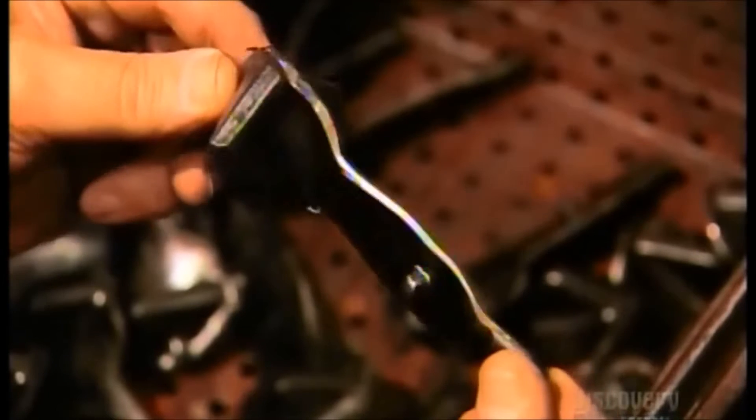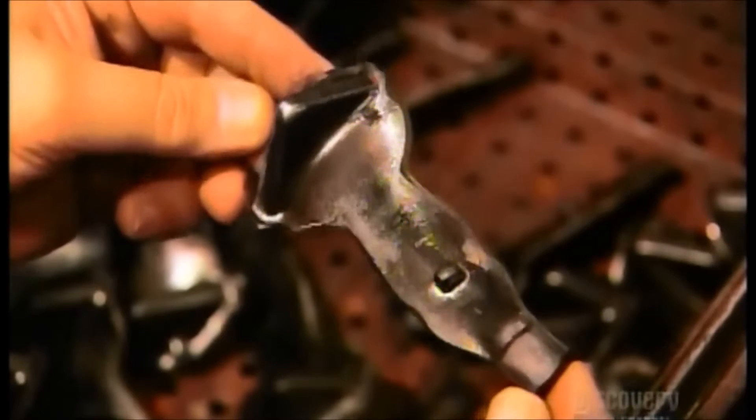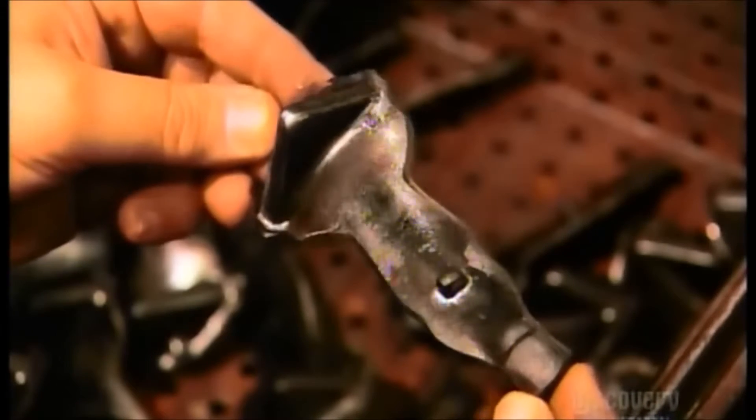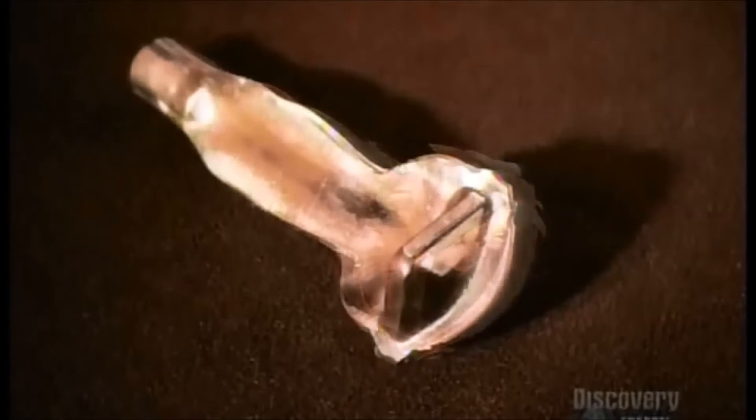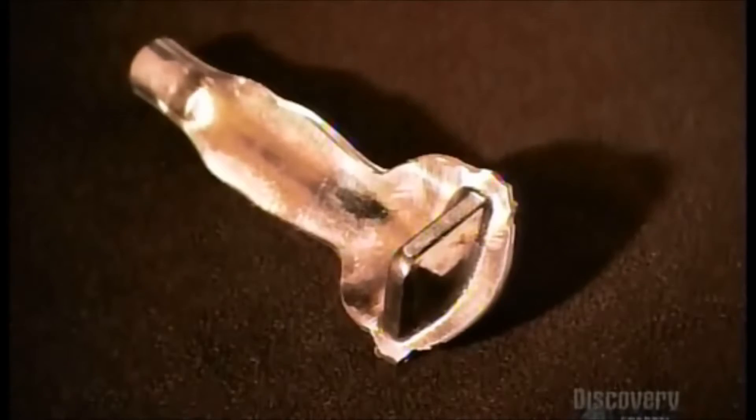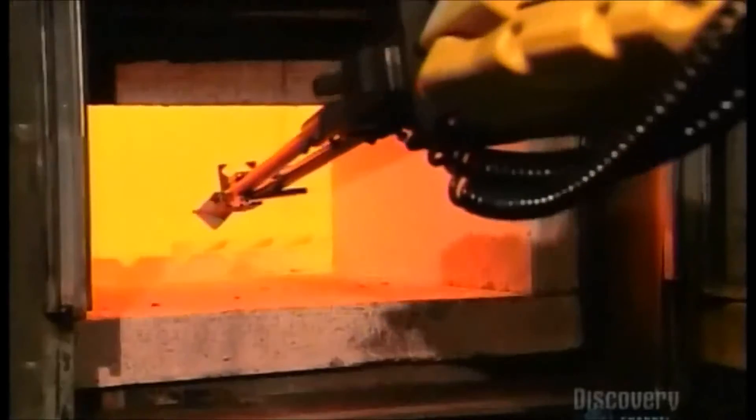Robots will shape the rounded base, called the dovetail, later. After a new ceramic layer is applied, the blade is once again heated in a convection oven to 980 degrees Celsius. Each heating and cooling cycle tempers the metal, making it more resilient.